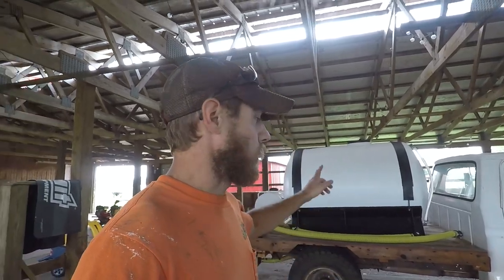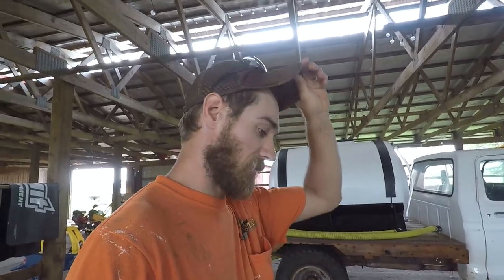got all the scum, got all the gunk off the exterior. Once that was done, then I wet sanded everything. After we were done wet sanding, then I did a complete degreaser cleaning of the entirety of the tank. Once all of that was done, and that process took 2 or 3 days right there, then I had to go out and I had a particular bonding agent. It's a really nasty chemical.